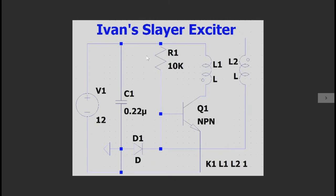Now, as for our R1, realistically, it's not even that necessary for this circuit. There will eventually be some random pulse through the transistor, which will still converge at said frequency. However, R1 greatly helps with the convergence time for the circuit, and it really improves stability. Keep in mind, depending on the transistor, the optimal biasing resistance value, R1, will vary, and it depends on the voltage too.